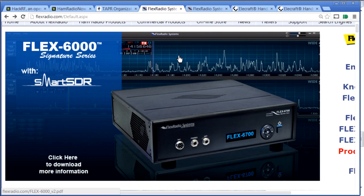They take advantage of being a software-defined radio to do all kinds of things nobody else is doing in the ham radio space. It starts with things like putting eight receivers with pan adapters in one radio, covering everything from a couple hundred kilohertz up past 60 megahertz, letting you see them all at once on one screen — or multiple screens — and hear as many as you can stand.